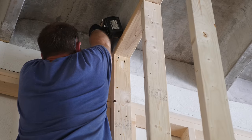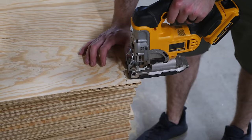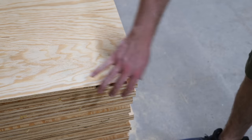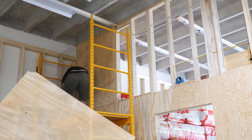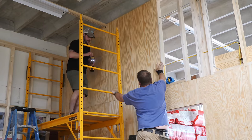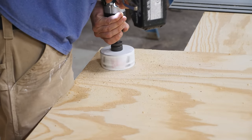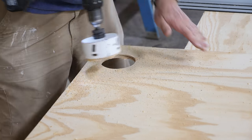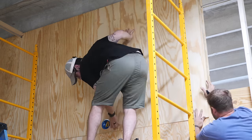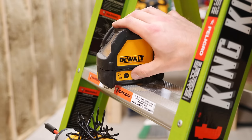With the first row done, we moved up to the second row to finish this side of the partition wall. We crosscut the panels for the second row, cutting all of them to the same length to keep them aligned. The panels had to be notched around the first row lights, which we did with the jigsaw. The scaffolding was a lifesaver during this whole build-out — definitely worth the investment for a project like this. I'll have a link in the video description below. The next panel had a round electrical box to work around, and Justin used a hole saw to cut the opening, although the jigsaw would have also worked.